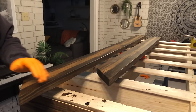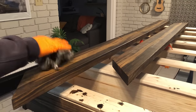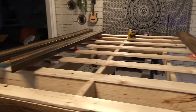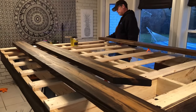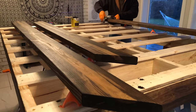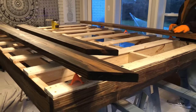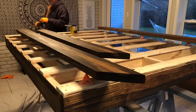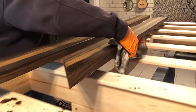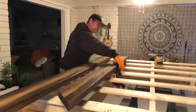The stain is on, and we're probably going to keep it to one coat — it was dark enough to really accentuate the different grain patterns. We still have to put the coats of poly, which will give it a beautiful satin finish and really elevate the result. We're letting the stain dry overnight — in my experience, that's the best way to guarantee a good finish. I struggle with patience and just want to sleep in this thing, but we've got to let it dry completely and we'll come back tomorrow to apply three coats of poly.